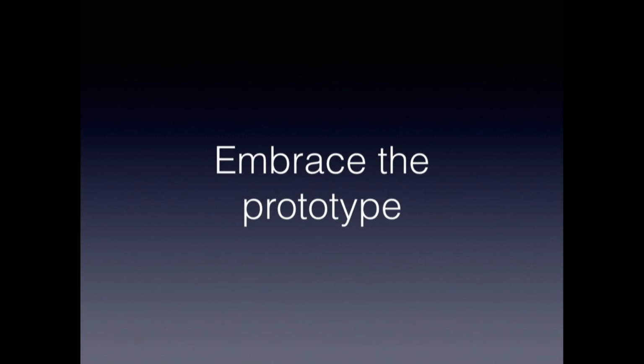The most important thing that I would like to leave you with in this whole talk is: don't expect to make your first iteration your final product. There's always a temptation to do that. We all are reluctant to spend money and time on new spins of boards and the iterative process. But if you accept the fact that you're going to have to make a prototype, that frees you up from a lot of things. It frees you up from the paralysis of perfection, for one thing. And it also allows you to incorporate a lot of features in the prototype that make your life easier during the development process, but which are not necessarily useful or necessary in a final product.